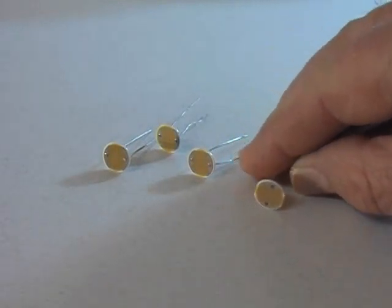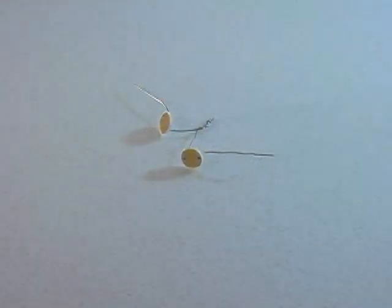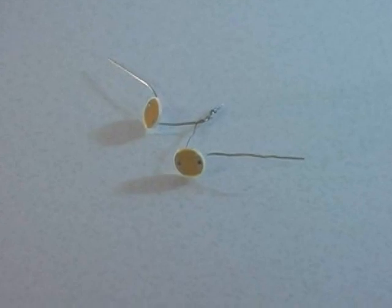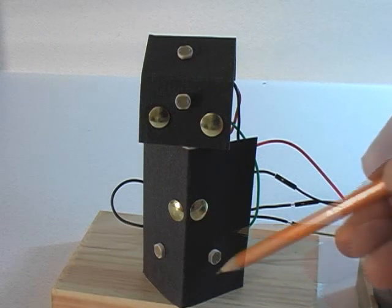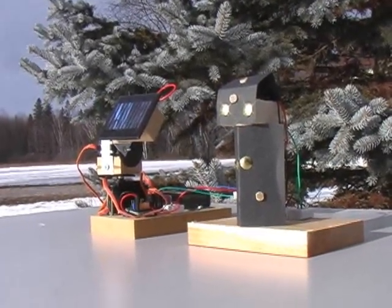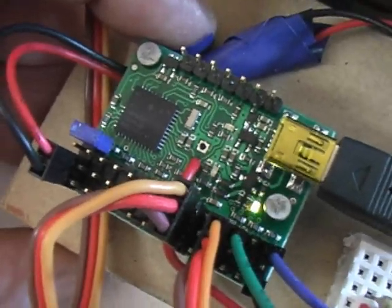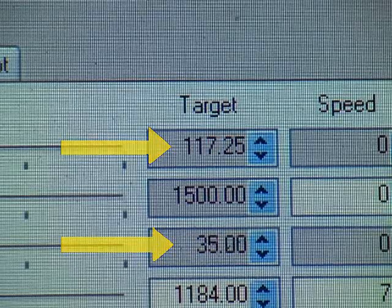Next we need to create light sensors. The simplest way to do this is to use two photoresistors configured as a voltage divider. Photoresistors are devices that change resistance with light level. Two photoresistors connected together create a voltage divider — make sure the current flowing through this configuration falls within the current tolerances of the board. I mounted the resistors in a mini tower with the two horizontal sensors at the bottom and the vertical sensors at the top. The tower sits beside the robot facing south. Light falling on the sensors changes their resistance and creates a varying voltage at the input pins. Using this voltage, the microcontroller generates a number for both the horizontal and vertical axes. These 8-bit numbers vary from 0 to 255 and provide information about the location of the sun or other light sources.